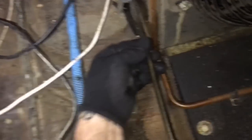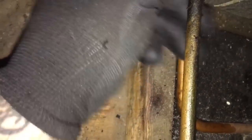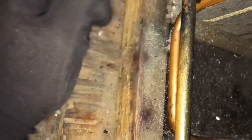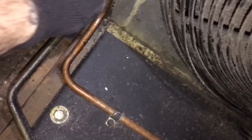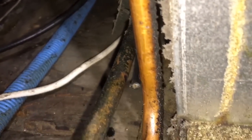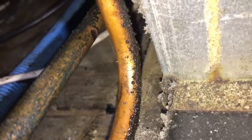Let's see what we can get into right here. That's the leaker — yeah, I can hear it. It's on this side, right here, on this pipe. And that one there started to rub through, and this one here got to rub through right there. You might be able to see it better from this side. There it is — the old rub-through special.